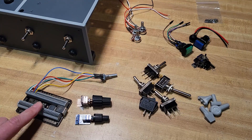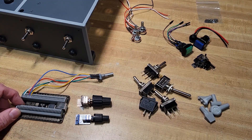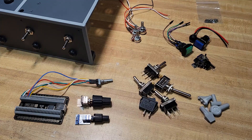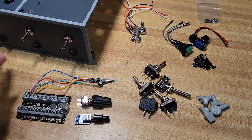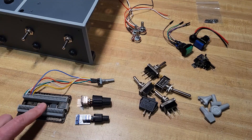Rather than doing Arduino - to play in DCS you can use DCS BIOS, but your board has to be programmed specifically for a particular plane. I want something that I can just have recognized like controller buttons, just like the Virpil throttle has all those buttons and switches that you can just bind in the game. These Leo Bodnar boards are more expensive than Arduino boards, but they allow you to do just that - they recognize all your switches in Windows without having to program Arduino to talk to a specific module.